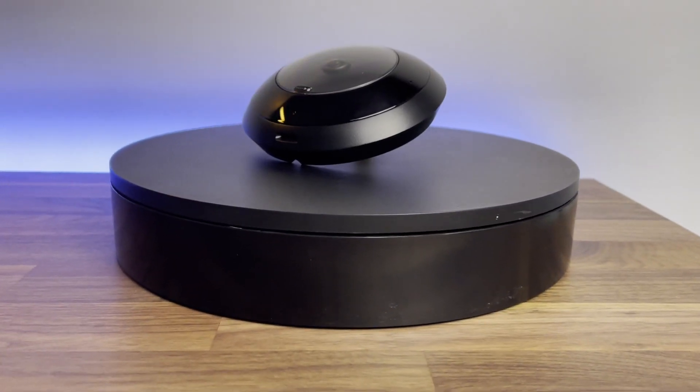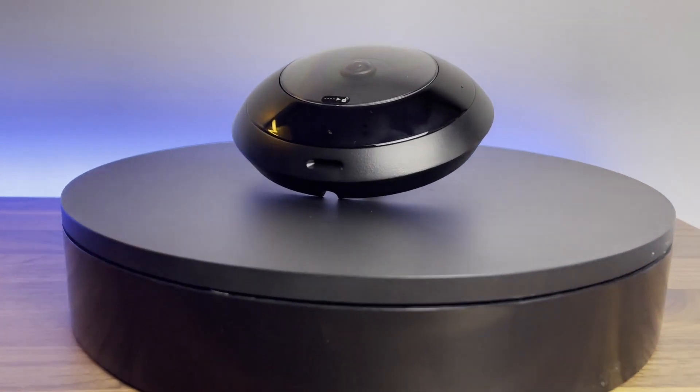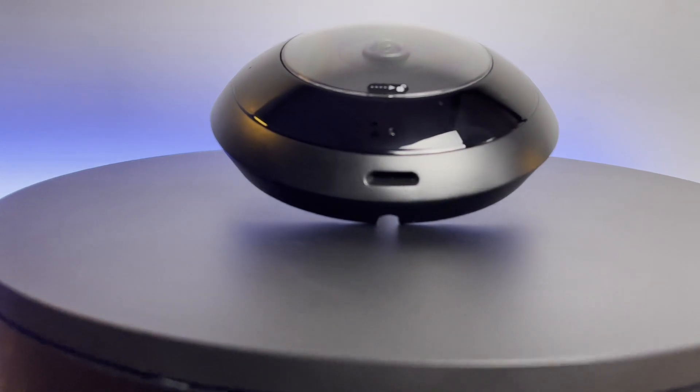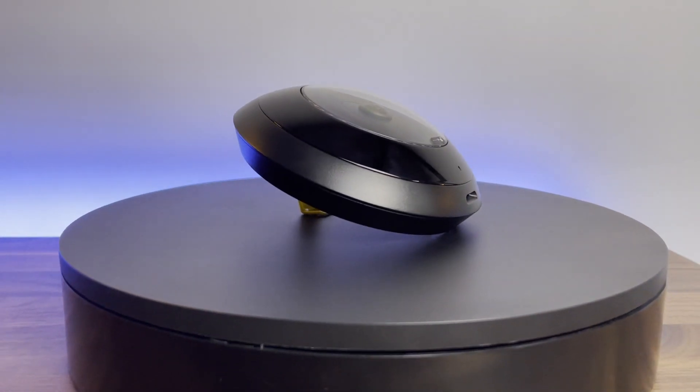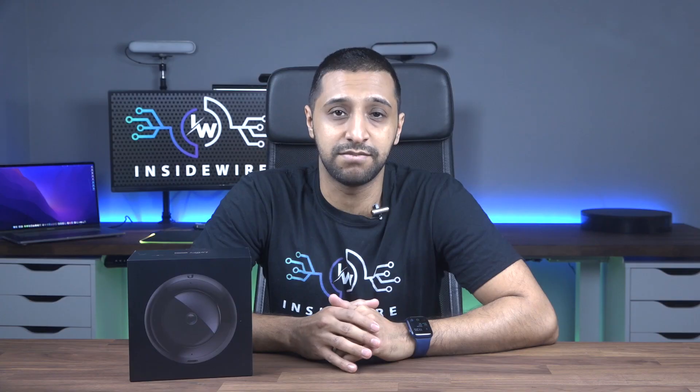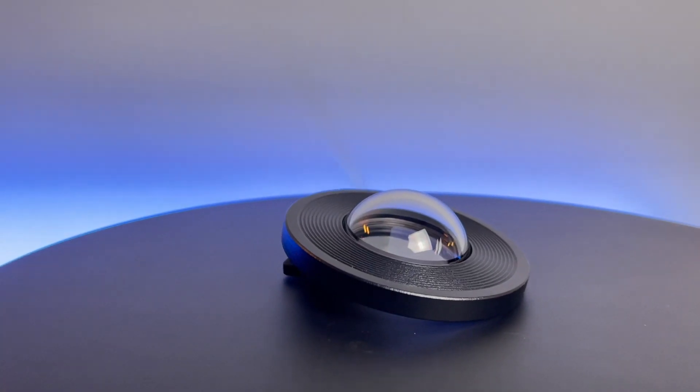This camera captures video at 1920 by 1920 at 30 frames per second. It has a fisheye lens and a 5 megapixel CMOS sensor, the same as the G4 bullet. It is IPX4 rated and IK08 rated tamper resistant, just like the G4 dome. It's powered by PoE and has two-way audio as well.